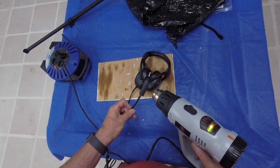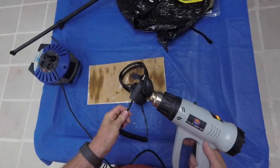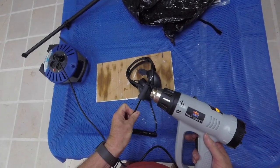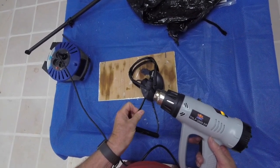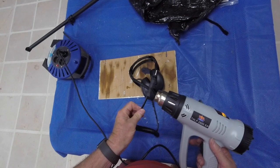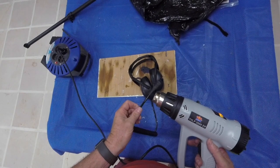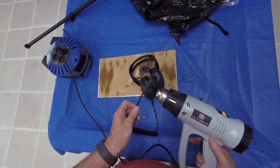Great, these hot air guns. Use it for loads and loads of things. It's got a variable heat setting, so it can be used from gentle warming, in fact just blowing air, through to taking paint off. I'm using 4:1 heat shrink with a glue surface on the inside, so it sticks nicely.